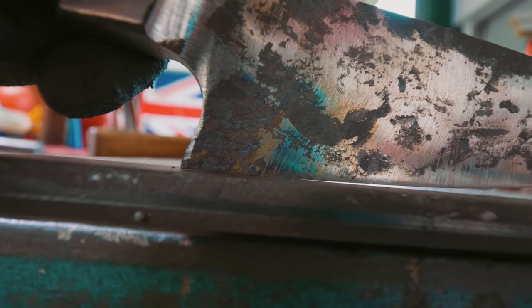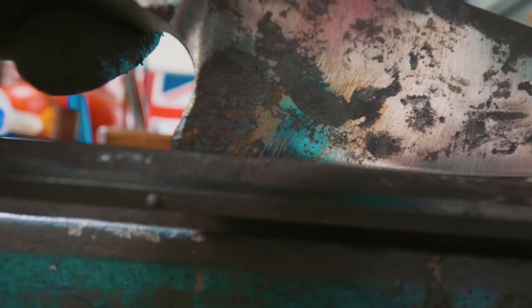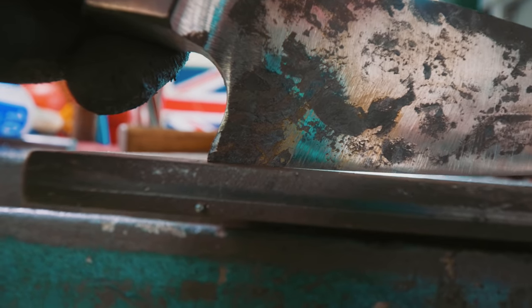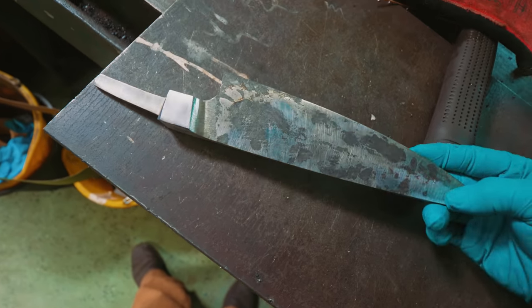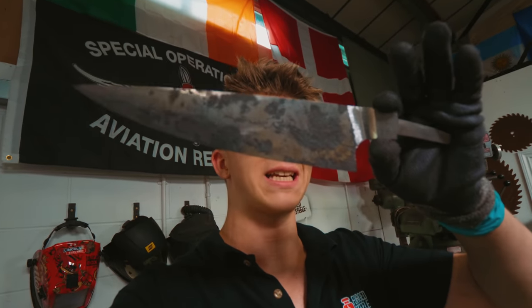Center screen right now — we could remove a few thousandths there, but this is a 36 grit, so that's not something to be majorly worried about. We are very close on the profile. I have then roughed in the faces, or rather just ripped off the scale, and I have been doing all of this with a well-used 36 grit belt because that scale is hard stuff. It'll tear up a new belt.